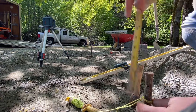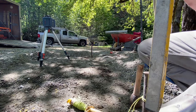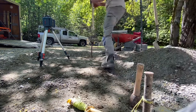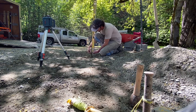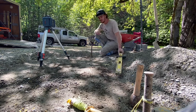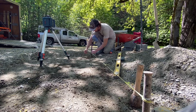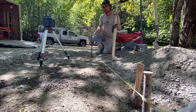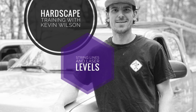At this point I'm setting up my benchmark height — that could be existing concrete or something you're going to work up to. I'm going to set my laser to that height and shoot that level line. I'm using the bottom of the stick to create a line that I can transfer onto the next stakes. If you're working with a slope, I'd mark the level point all the way across on all perimeter stakes for an excavation or base prep, then measure down or up from that level line to create your slope. I'll get into more detail in the next videos — stay tuned.